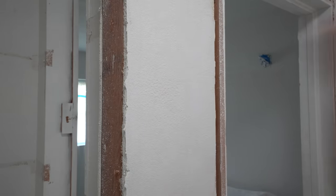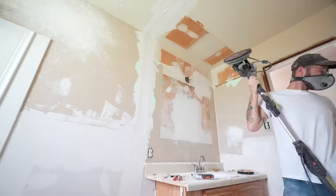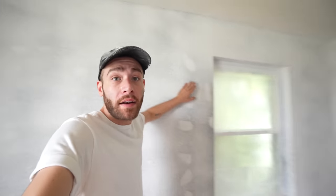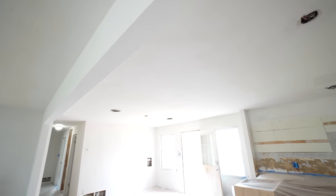This right here is an example of some of the rippling I was trying to avoid everywhere — if you got a little too heavy of a hand this will happen, but it's so easy to sand smooth with 180 grit. The bathroom's looking super fresh. You can still see the spots where I had to patch holes in the wall, but to the touch it's completely smooth — I think once we get white paint on, all of these spots are going away. I got great results for under 200 bucks — the sprayer rental was about 100 and the joint compound was about 75. If you've contracted this out recently, let me know what you spent. I know I'm not a pro but I got good results on my walls and the ceiling so I can't complain.